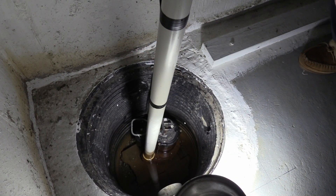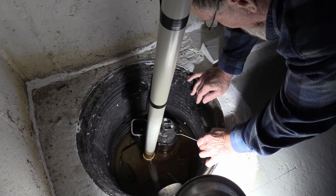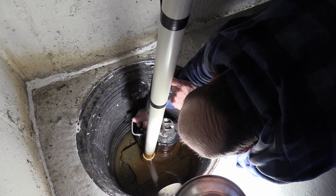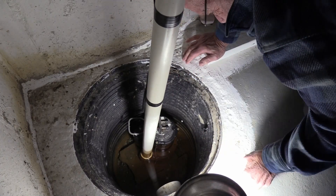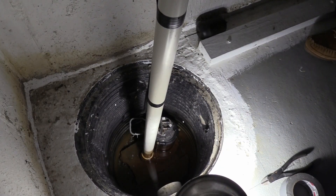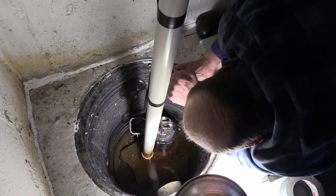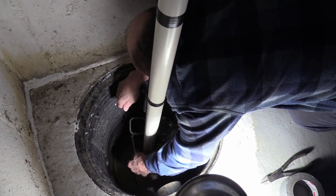Okay, so the first thing I'm going to need to do is unplug the pump obviously. And then once the pump is unplugged, I'm going to take this switch and make sure that it's up in the closed position. I think what I'm going to do is take the bulbous float right off. I'll be back in a moment. Okay, so now that the bulb has been removed, I can - and I don't know if you can see it - but there's a switch on the back side.